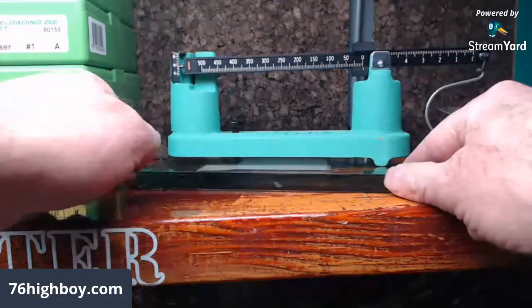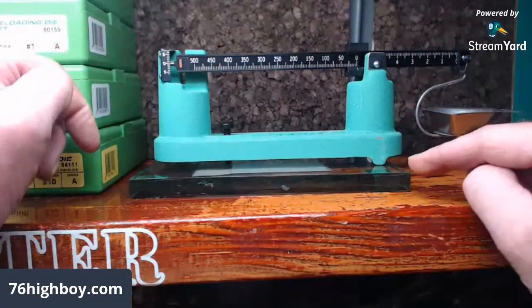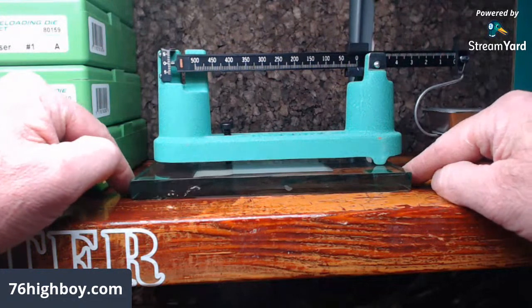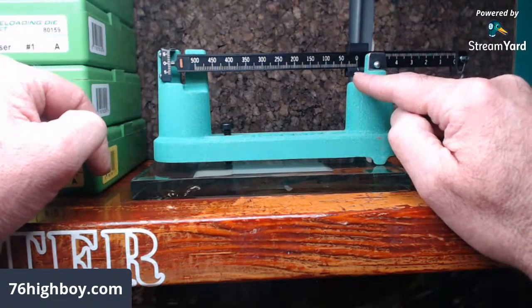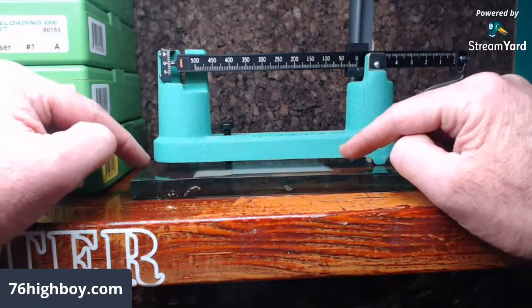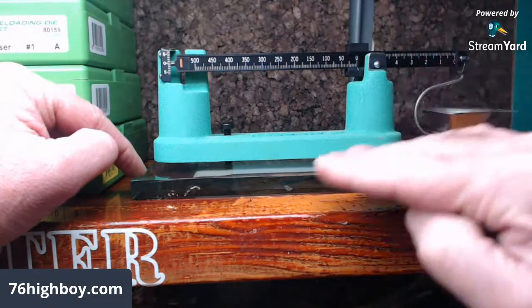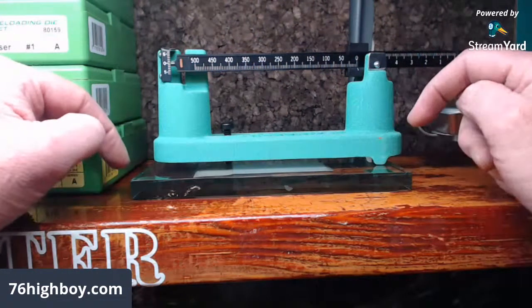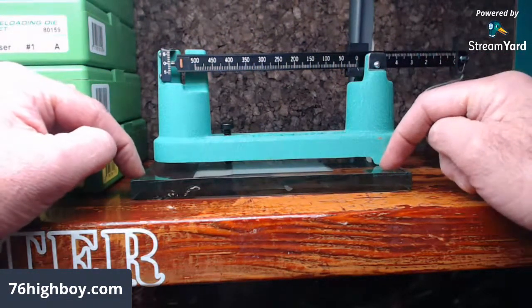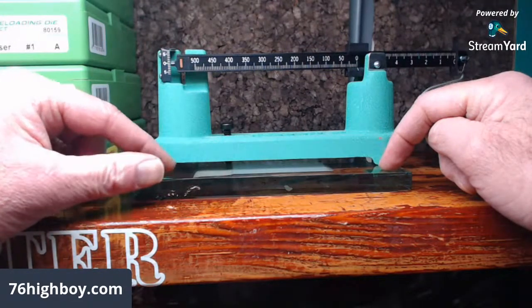The other thing the glass does, I'm going to tell you what the glass doesn't do in a moment. The other thing the glass does is when you are adjusting your beam for different counterweights, it's going to hold 0 longer because of the extreme smoothness and its rigidity and its perfect straightness. Now, if you get glass, get it tempered. This tends to chip, and man, it sliced me open a few times.